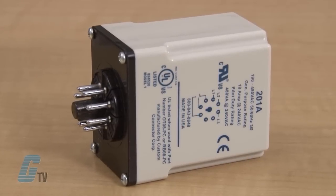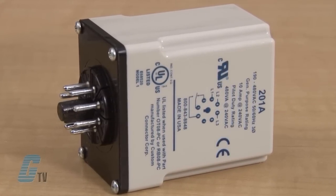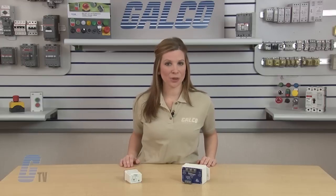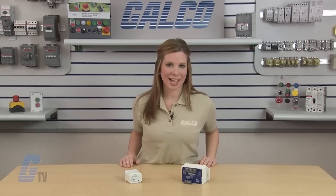The 201A is 8-pin socket mount with optional high voltage detection on select models. The 201A does not come with the same options as the 102A, but the 201A AU comes with an adjustable knob to set a 1 to 30 second trip delay, a manual restart or 1 to 500 second restart delay, and a 2 to 8 percent voltage unbalanced trip point.